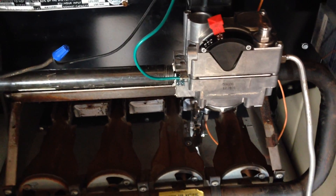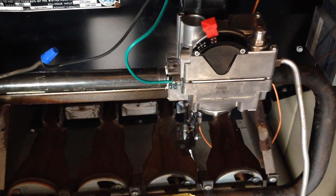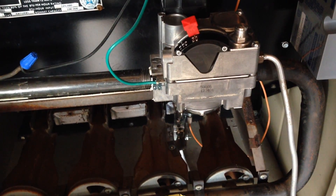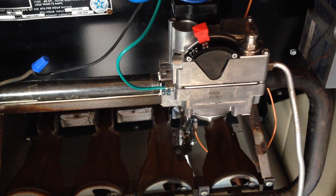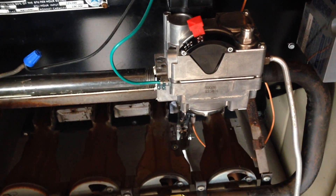I've already done this, so let's go ahead and bypass the thermostat and test the operation. Make sure the pilot is in the proper spot for the main burner. Let's make sure we get proper ignition and then test all your tubing for gas leaks.